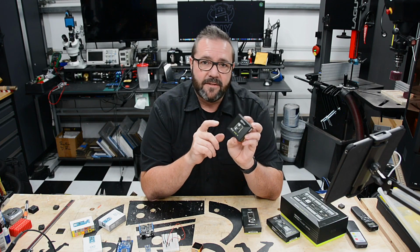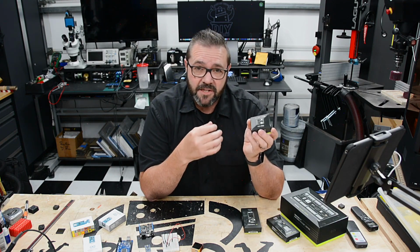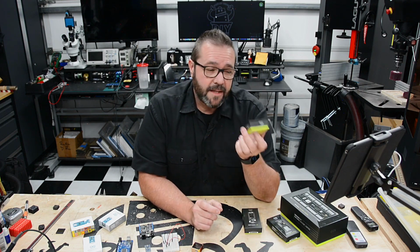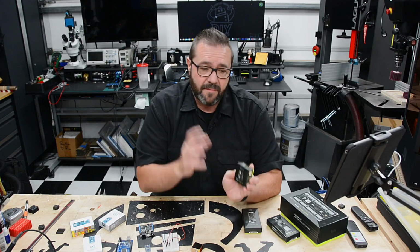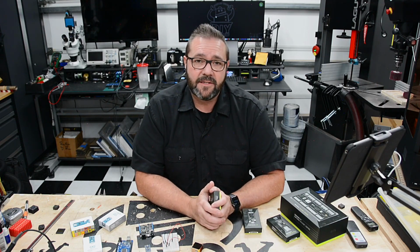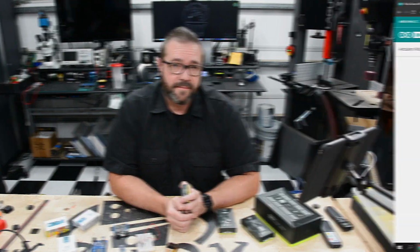And it's got lots of sensors that can tell you about the environment, like an IMU or inertia measurement unit, barometric pressure, air quality, accelerometer, compass. There's lots of capabilities to this little guy. So we're going to jump over and look at the data sheet for it, and that'll tell us all the specific capabilities, and then how we can apply it to our environment, to a new project, to add a digital capability to make smart projects. All right, for that, let's head over to the computer.